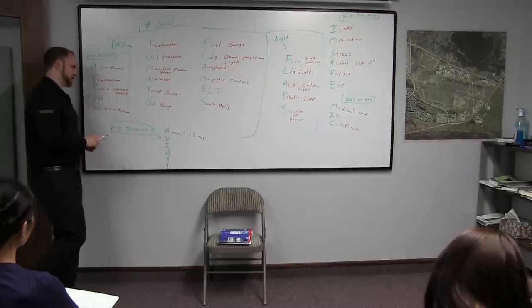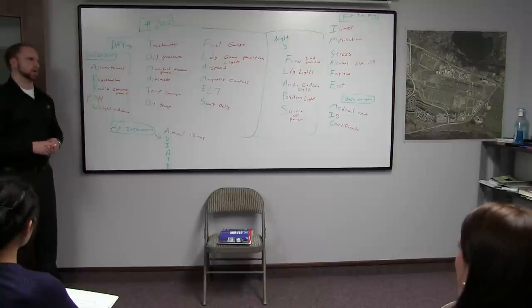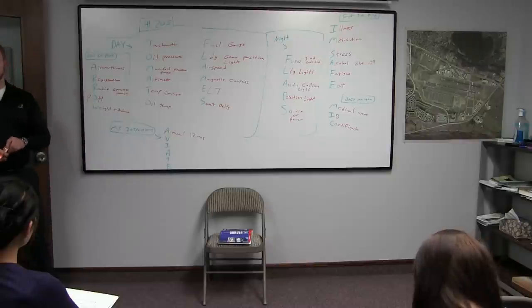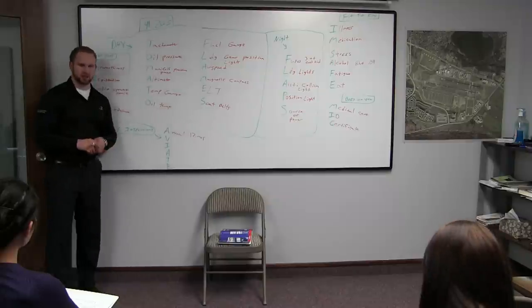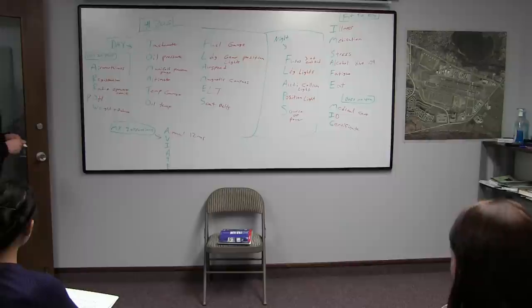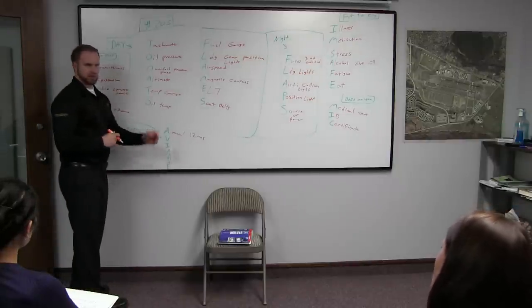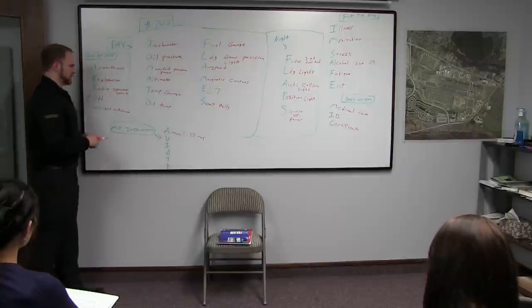An annual inspection is a very thorough inspection. The seats come out, the carpet comes out, all the wing inspection panels get popped, the engine gets compression tested. It's a full walk around. On our 172, it's a 17-hour inspection for an annual by a mechanic. It's very labor intensive, it's expensive, and if you own an airplane, every 12 months you have to do it. Even if you only fly 1 hour, it has to go through an annual again.